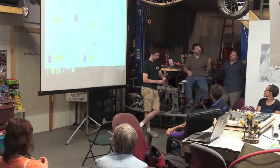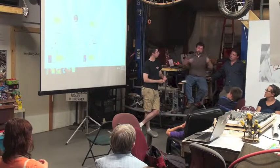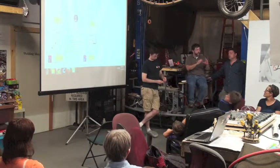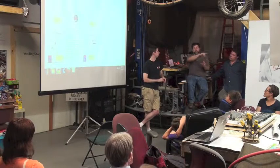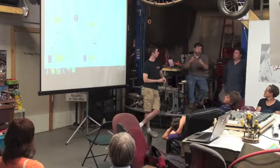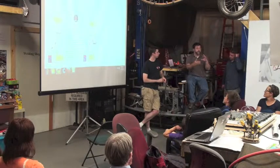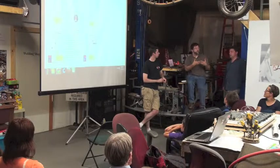It uses a one-time pad encryption algorithm, so it's a pre-shared key. You can pre-share on an SD card, let's say a gigabyte or 16 gigabytes of key data with someone else, and then you would use that SD card in this device. To send a message, you type the message on the device, and then it plugs in via a USB adapter and simulates the keystrokes on your actual PC, where you then send the message. For receiving a message, you would get it via email, or you could literally print out that message and mail it to someone. To receive the encrypted message into the encryption device, you use an onboard camera to OCR the encrypted text, and then it will decrypt it again on device. So the only place where the decrypted message lives is on the device itself.